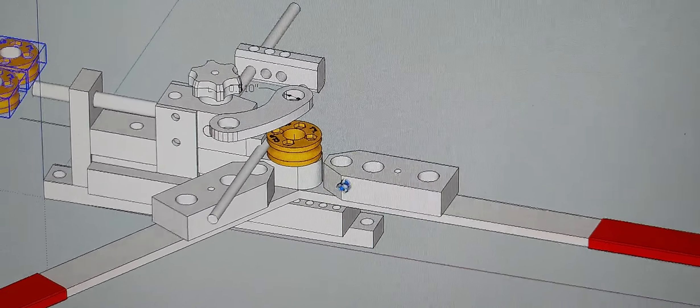You can see here I just made a perfect 90-degree bend. You can see the slight indentations — if you look at the shadows, that's where the die starts and this is where the die ends. I made these markings at half-inch increments, so this is one inch from the start to the end of the curvature for a 90-degree bend for this particular quarter-inch aluminum tubing.